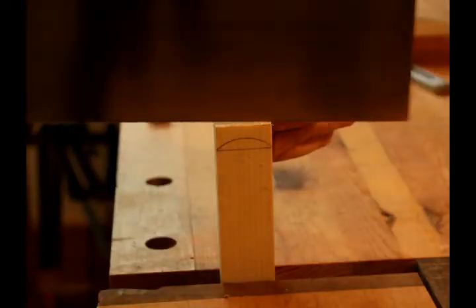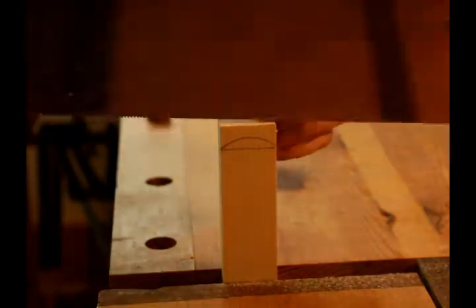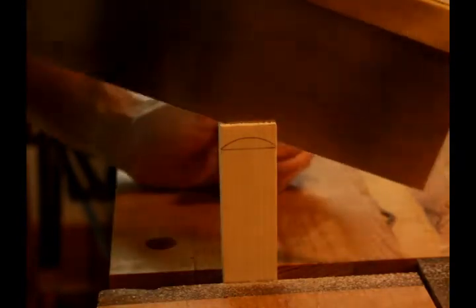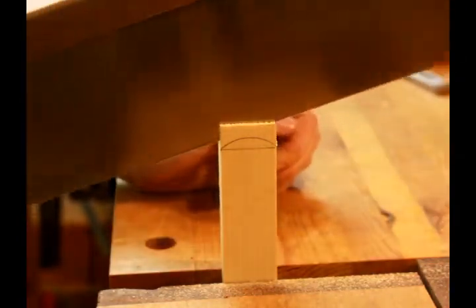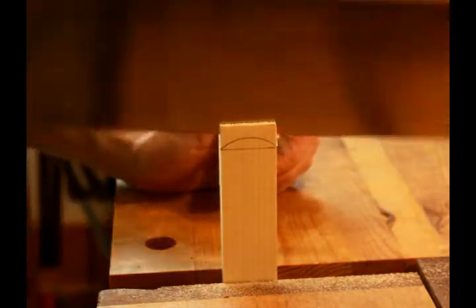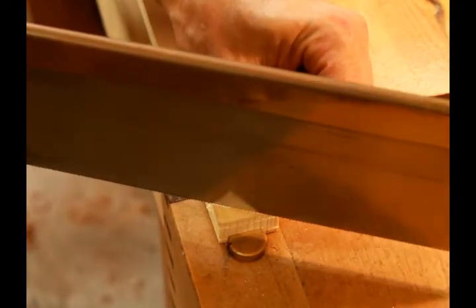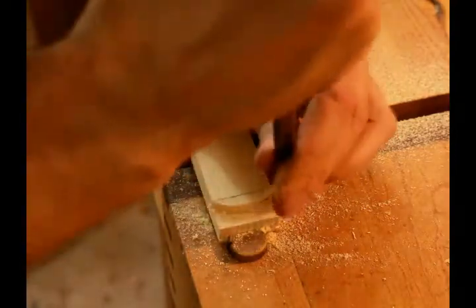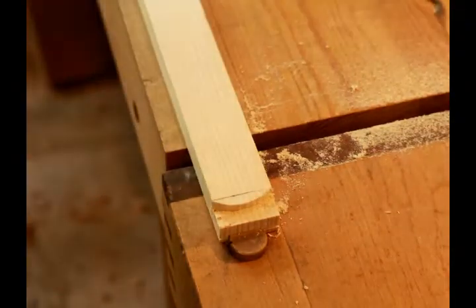I then went on to cutting my tenons. The tenons have a center part that's straight and then the shoulders are curved so that they can fit into the curved portions of the handles. So I just cut down to the center line and then arced the saw over, then flipped it on its side and cut away the circular parts with the chisel. I just cleaned up the outside a little bit to make it smoother and more presentable. It came out pretty good, but the shoulders themselves are very thin because the wood itself is thin — that turned out to be a problem, which I'll explain later.